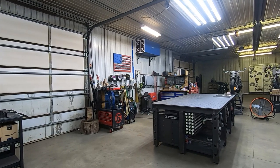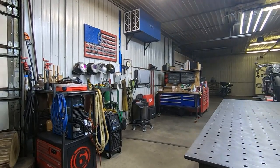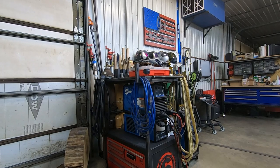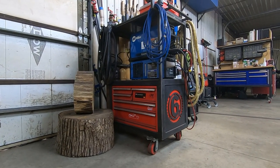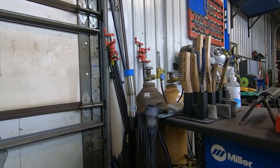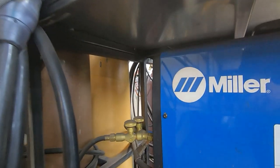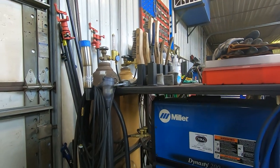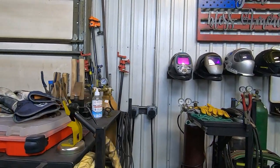Now we're going to my general assembly and welding area. Here's my welding equipment. The first cart is my TIG machine — it's a Miller Dynasty 200 DX with a water-cooled torch. I integrated it with Harbor Freight drawers for storage of lenses and supplies. In the back are two tanks: one argon, one helium. When I weld thicker aluminum, the helium adds that little bit of punch that my TIG machine lacks.